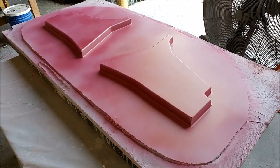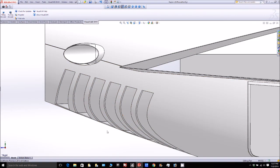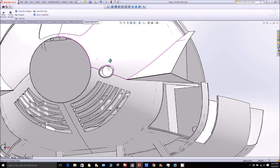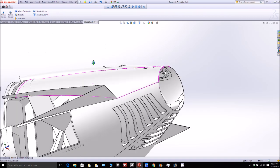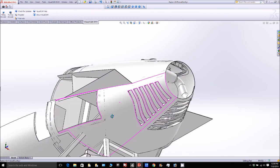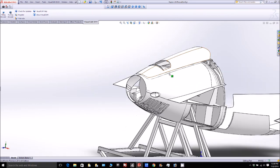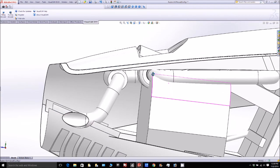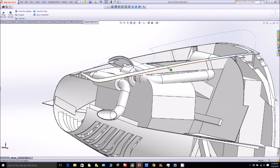Here's an update on the engine compartment. Here's the lower cowling — you can see I've basically louvered that so all the heat coming off the engine and through the inlet can exit out the back. We need about 150 square inches of area there compared to the maximum inlet size — our inlet is adjustable, so the louvers are quite large. Moving the cowling, you can see the exhaust system. We're actually going to put a muffler on the system — coming out of the turbo it's already quiet, but going through a small muffler should reduce sound by another 15 to possibly 20 percent.